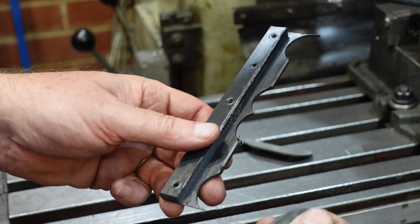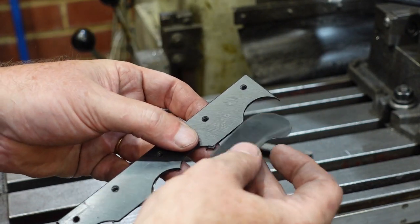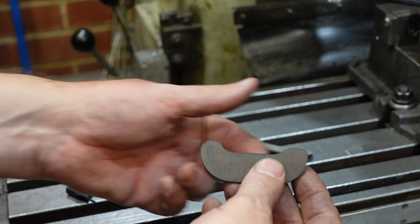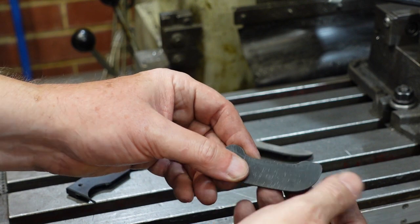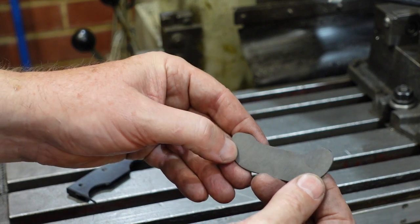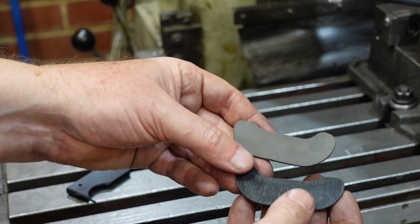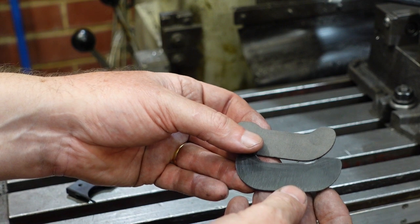Merrily milling away bits and pieces there. The final bit — I milled that section out and then just used a hacksaw to cut the sprue off to get the cheek piece. That needs slight flattening because of the digital readout, so that was just a little bit of lapping there. I now need to finish these up. I tried using a little bit of 180 grit and that lost a bit of the gloss, so I need to go a little bit finer — I don't particularly want it shiny, I want something halfway in between. Anyway, that's a Volstro head, and that's one of the things it can be used for. Thanks for watching and we'll see you for the next one.